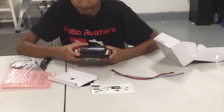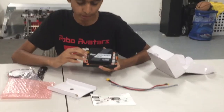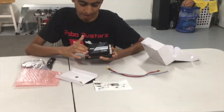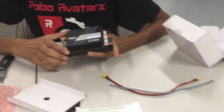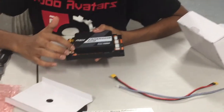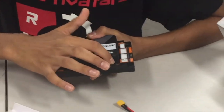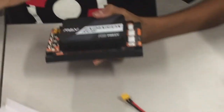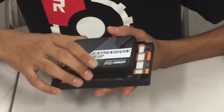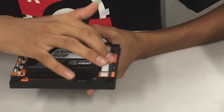Let's look in depth into what this module brings to the table. First, we have these four ports which are for motors. Next to each motor port we have an encoder port, so for each motor there's a corresponding encoder port. Over here we have six servo ports where you can easily plug in servos. On the bottom we have five volt power ports, which you can use for things like LEDs. We also have analog, digital and I2C ports.